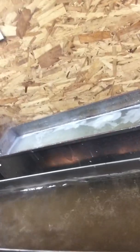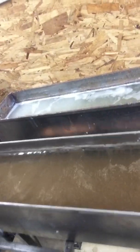After it boils in that tank for about 30 minutes, I put it in this boiling water tank just to get any extra salt off of it. And then after that, we go over and soak it in this oil. You can see I've got an old Winchester .22 in there, and a Mosin Nagant somebody wanted me to reblue for them. They're going to look really nice.